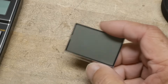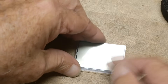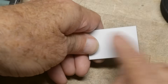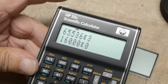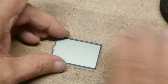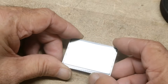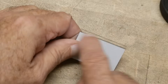The construction of these things — you can look that up, that's not what this video is about. There are sandwich plates of glass with material inside that can change the polarization of light, and there's a polarizing filter. In a reflective one, there's a mirror on the back. When you energize them with electricity things appear, because the top piece of glass has indium tin oxide (ITO). ITO is a transparent conductor patterned into the shape of whatever you want to see — so for a seven-segment display you'd put seven stripes on the ITO and bring them down to connectors.